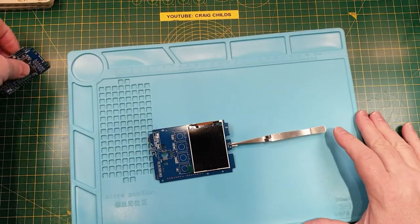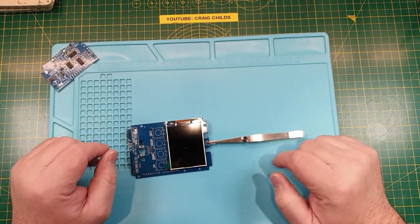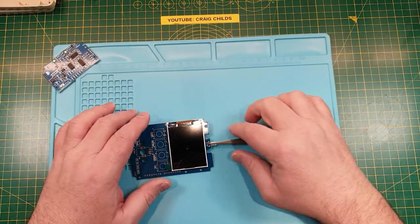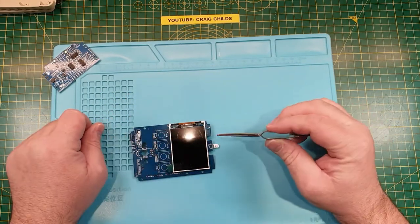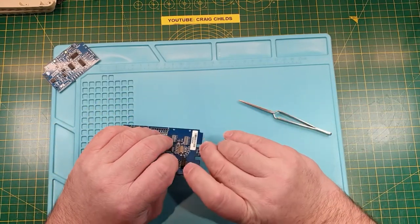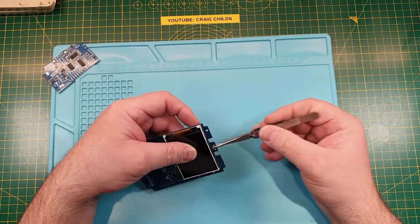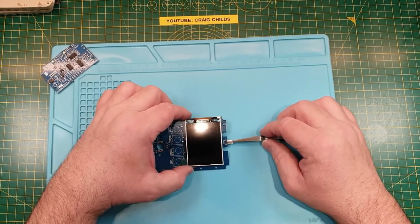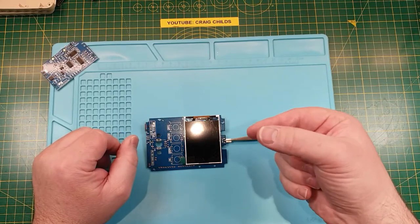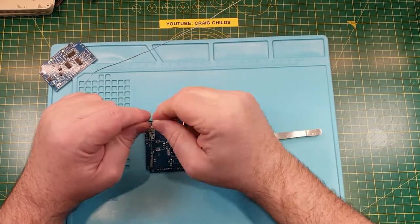Okay, I've just brought in my silicone soldering mat because a few of these components are going to be really near the bench edge when they're being soldered, and I don't want to melt my cutting mat. If you've got a component that's really near the edge of a board, these little tweezers are handy. They're forceps tweezers, so when you let them go, they grab. I've seen a number of different techniques for holding components onto boards. I use some myself, like I've got a pack of Blu Tack. The only problem with doing things like that is they tend to make a bit of a mess of your board and there's more cleaning up to do. This is really handy just for things like this where connectors are at the edge of the board. It clamps onto the board while you're soldering it, so it does it without making any mess. So you've got a lot less cleanup to do at the end.